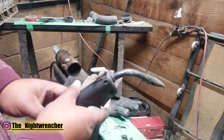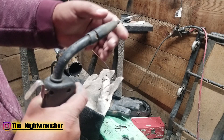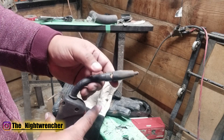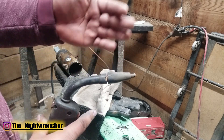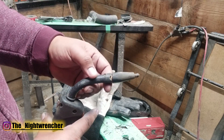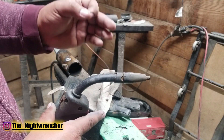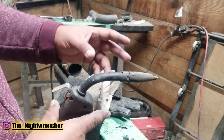The last tip I'm going to share pertains to the wire you're using to weld. Typically, a lot of machines come factory with 0.035 wire when you're welding with flux core. The best welding wire I've been able to find that welds the nicest has been 0.030 in terms of size, and my personal favorite is the Lincoln wire. I've used Harbor Freight wire and I don't really like the way it flows. I like the Lincoln inner shield wire — people can pick whatever they want. There's not a big difference between 0.030 and 0.035, but when you switch to the thinner wire, you're going to need less heat to get your solid wire into a liquid state, and you're going to be able to weld a lot easier.